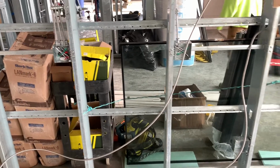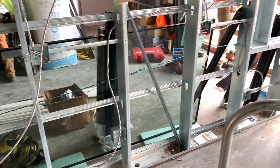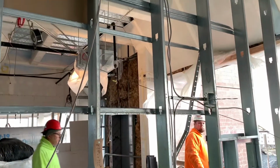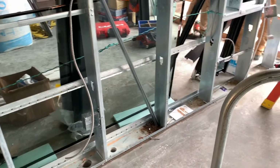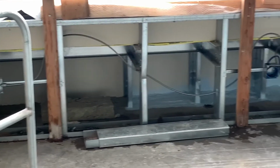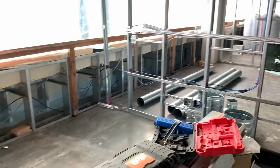Moving on to the kitchen, this is where I ended the day, but I just landed the home runs in the boxes with the kitchen jumpers between the plugs. I got the microwave landed, the range, still have to work on the dishwasher and the disposal plug itself, and then one other plug that's hanging there because the people ripped it off the wall to walk in between the walls for their ease. And then wrapping the living room right here with the plugs